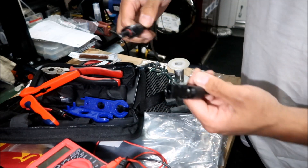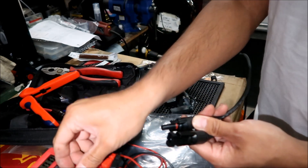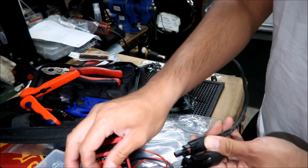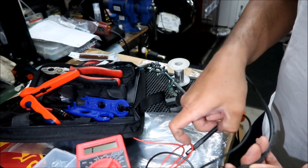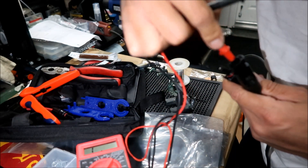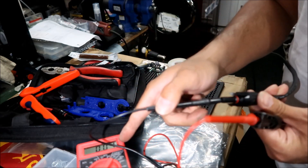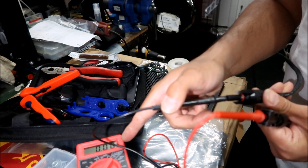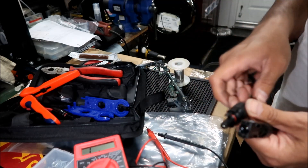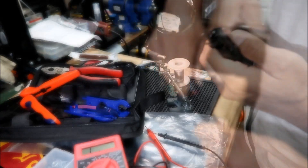You can test it out. I'm going to put my multimeter to measure resistance and then connect these two ends together. We got 0.00 ohms — that means there's a connection. Then just make sure these connect fine to each other. Pretty sure we did it right.